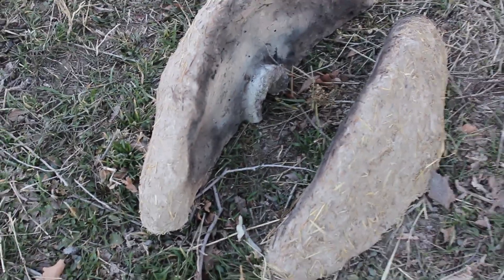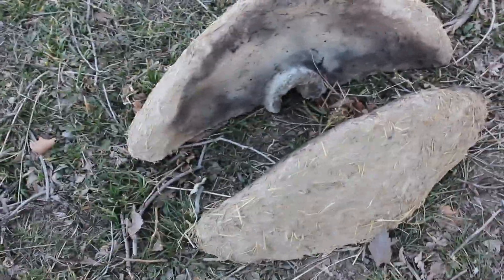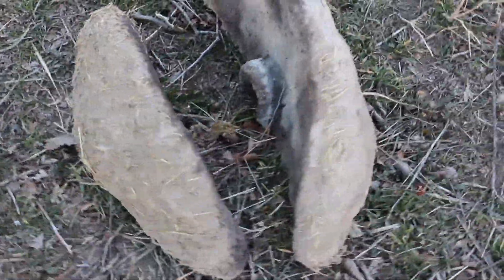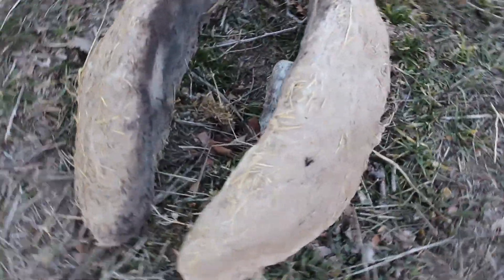You can see here that we formed a hole in the base of one of the trench walls. This is the tuyere, the opening that permits airflow into the heart of the fire. It's also where, because of the increased oxygen coming from the bellows, the fire will be hottest.